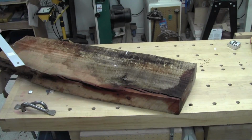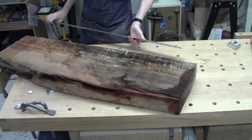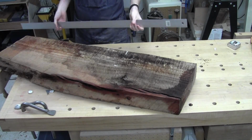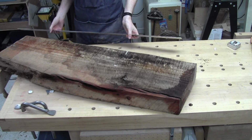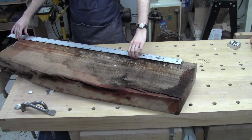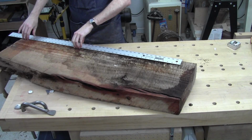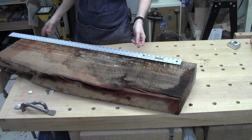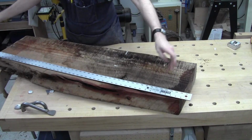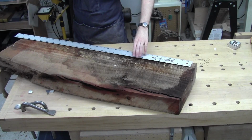Well, the rain is coming again, so I'm not going to be on the chainsaw, so I'm just going to start layout, and I think I'll try a couple of things. I'll try my circular saw, get as much depth as possible, and then see what I can do. We'll see. But we're going to mark the lines, and then check this edge. It's not bad, straightness-wise. I might lose an 1/8. Not bad. For as winding and bad as this is, on this side it's way off, right? But not bad on this side, because I ripped that with the chainsaw a long time ago.